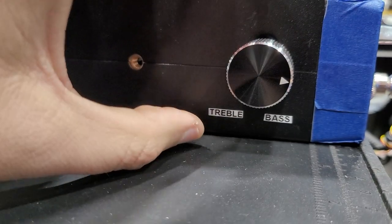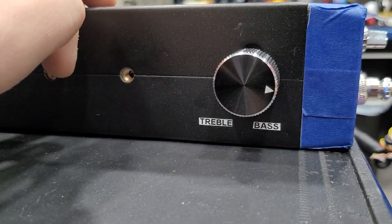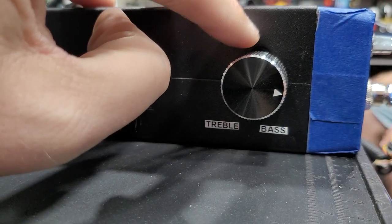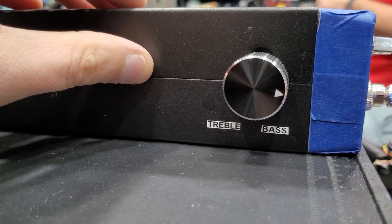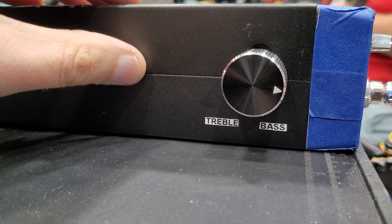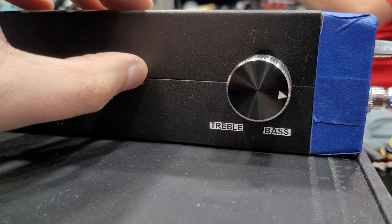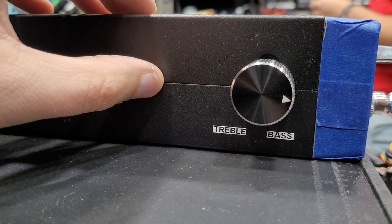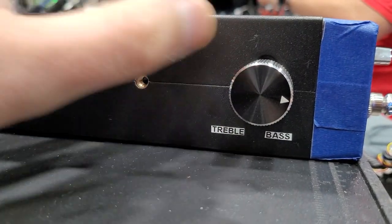With the modified microphones that I do, the D104s, the 878, they're all going to sit somewhere close to that 3 o'clock position, roughly. If your voice is a little different, you might lean towards 12 or above. Handheld Superstar microphone sounds real good with them too. The stock CM4 sounds great with my radios. It's the best of the stock mics for hi-fi. And that one you may be able to go a little closer to wide open on the bass. You'll still crack it open just a little bit towards the treble side. So that'll kind of give you an idea.